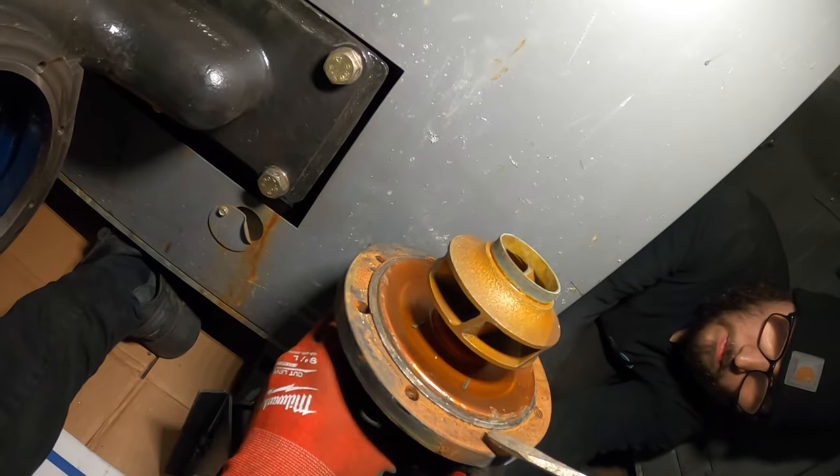From here I'm gonna wire this motor — it's pretty straightforward. This is a single voltage motor, unlike the other one which was dual voltage. We're just gonna put the hot line, neutral to neutral, ground to ground. Black is your hot, white is your neutral, green is your ground — just match up each color. Black with black, white with white, green to green. That's ready to go. Let's put the cover back on — you can see the color difference between the new one on the left and the old one on the right.